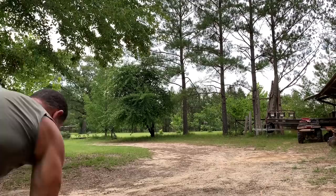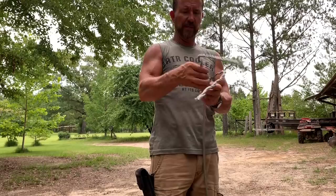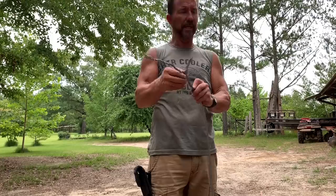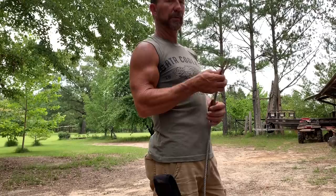What I did is I went and got a different cable, which is a whole lot stiffer and a whole lot harder to work with. Now, I want to start from the beginning. I was just trying this one out before I started the video, and it's really a pain. The soft, pliable cable is normally what comes on a winch, so if you're in the woods and you bust a cable, more than likely the cable that comes on the winch is going to be a whole lot more pliable than this right here.